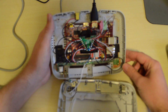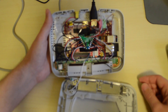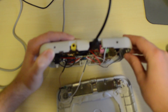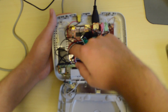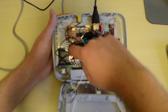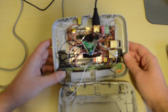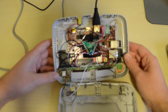As far as changes I've made to it, I actually really haven't done much of anything. I desoldered the original power jack off of the PlayStation 1 and just kind of hot glued it there in place. And then routed the wires over here to the input, just underneath the board there. So there's no actual jack plugged in there, but the power still goes there just fine. And then I interrupted the power line with the original PS1 power switch here, so you can still use that to turn it on and off.